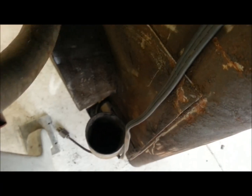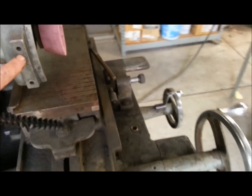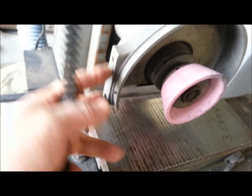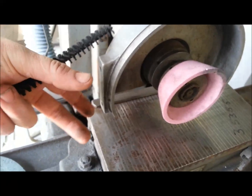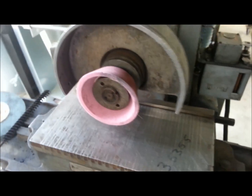I've run the blower and it runs really well, very quiet, with a lot of air volume. So I'm going to get this dust collector working — it was very clogged when it came to me. That's the intake pipe right there; it just gets a flex hose that flexes up to a cover. I've got two bolt holes here and a cover, and the dust collector outlet is right here to the side.